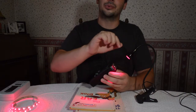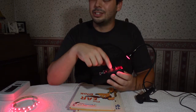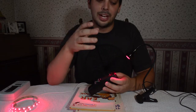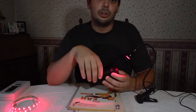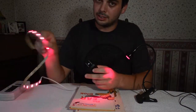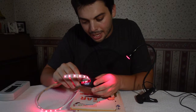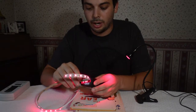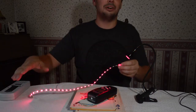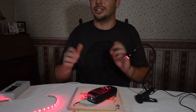So it's about 100 milliwatts per centimeter squared, which looks pretty good. But since this reads falsely high, I'd almost expect the real value to be about half — so maybe around 40 milliwatts per centimeter squared. I'll update the website once I get professionally measured numbers. Comparing it to the Rave's individual bulbs, holding it up to one of those I read anywhere from 10 to 15 milliwatts per centimeter squared. So each individual LED on the Rave is doing about 10, while the single Crane LED reads 100 — that gives you a sense of the order of magnitude difference.